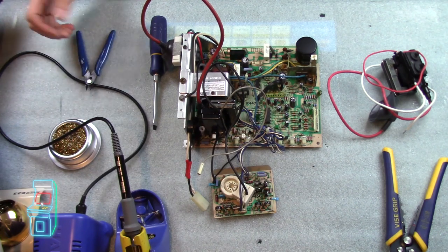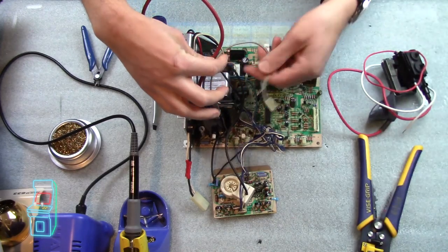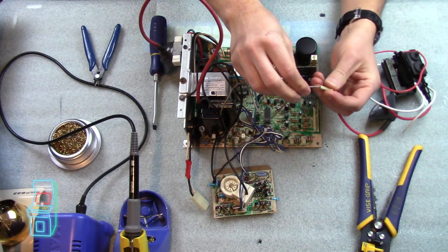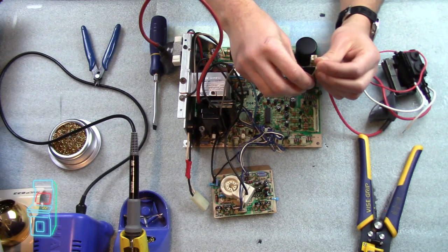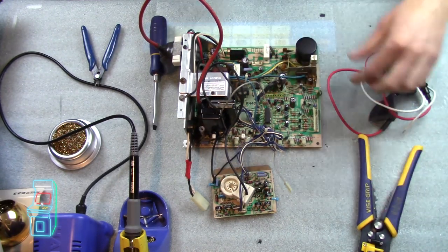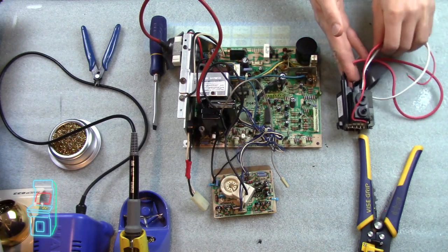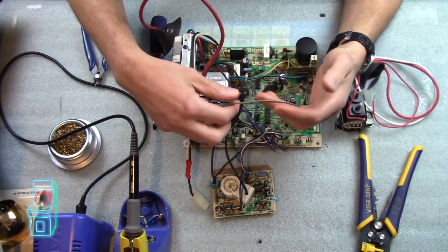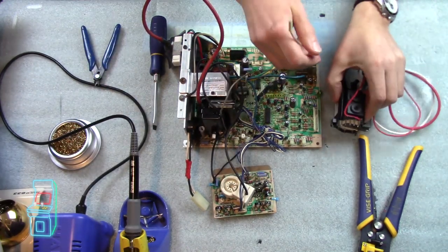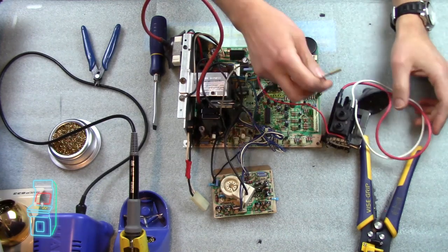So I just have the basic tools. You need a cutter. On the old flyback, you can see it has this little connector here, and I want to kind of save that. I think you can put a little pin in there and kind of remove it and re-solder it, but I'm not going to go through that whole trouble. I'm just going to cut it right here, put a butt connector right onto it, and then just put the new flyback portion on. The one you know which goes where — the thinner one here is a thinner gauge. So if you ever have this disconnected or need to switch anode cups or anything, always go with the thicker versus the thinner.